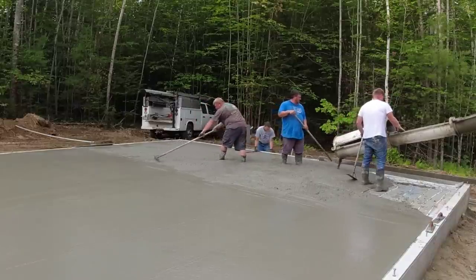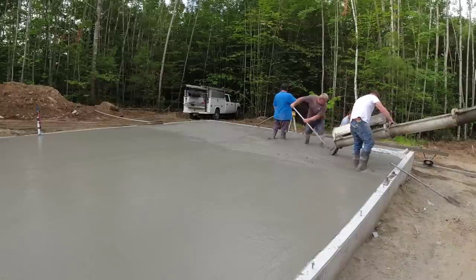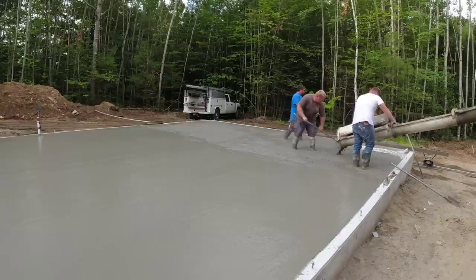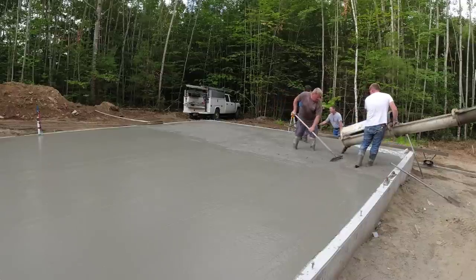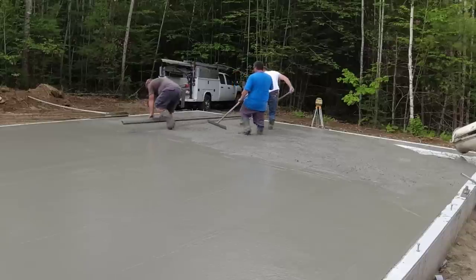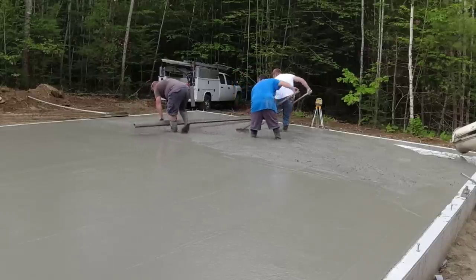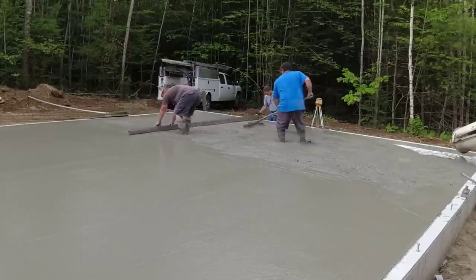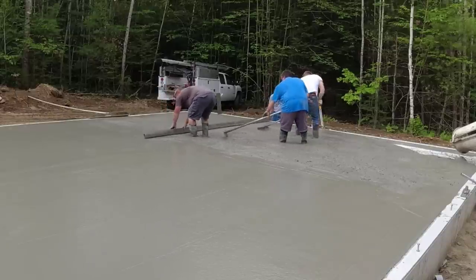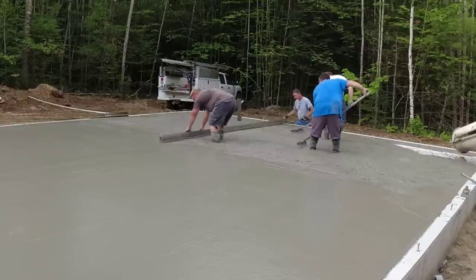And then in the top of the wall, the foundation guys, they got their anchor bolts in there to bolt the plate down to start building the house. This will all be stick built. What we call stick built, so they'll probably use 2x6s for walls. They'll lay out all the 2x6s on the floor, nail them together, and then stand the walls up in place. And that's what I mean by stick built. Places like this usually aren't prefabbed.